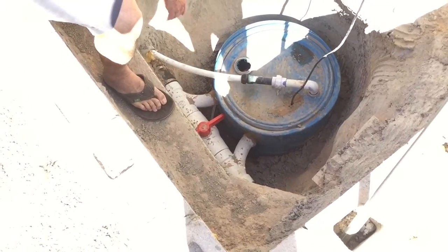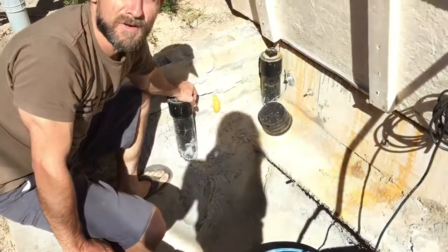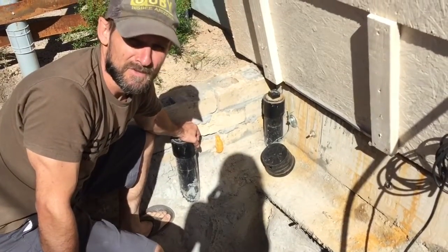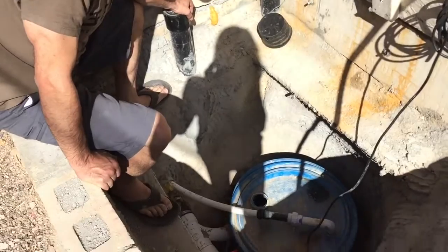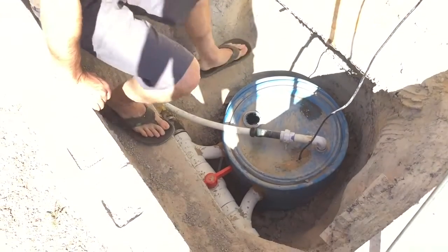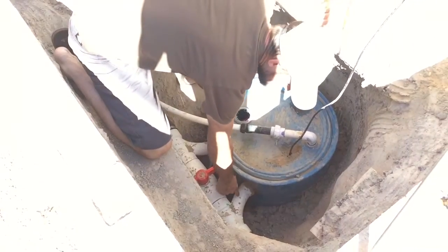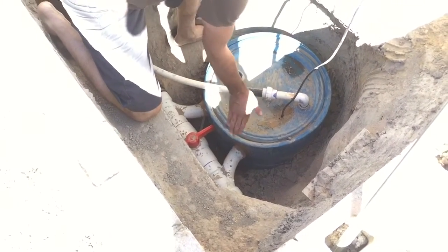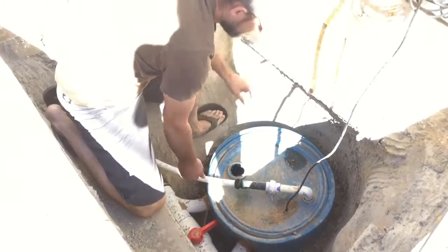I have a series of valves that allow for redundancy so there won't be any overflow. You don't want your gray water to overflow because then you have basically sewage in your yard — not good. These valves allow for redundancy so it doesn't leak into the yard. This T here is actually a flapper valve, which is a one-way valve that allows the tank to drain should the pump ever fail.